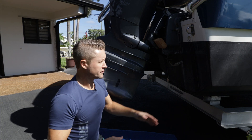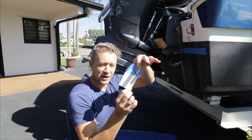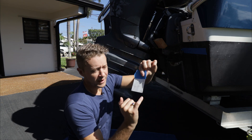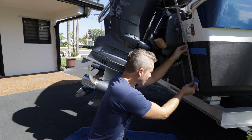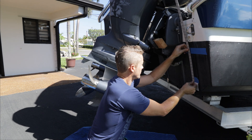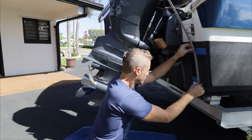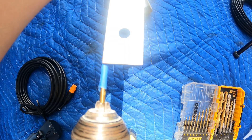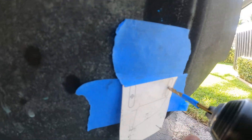I'm going to start by establishing our waterline so that we know exactly where to put our transducer — it needs to be parallel to the waterline. Garmin provides a handy template that you cut out. There are just two screw holes that go into the transom and the bottom corner needs to line up with the bottom of your hull. It's measuring right at nine and three-quarter inches on both sides. Garmin recommends a 5/32 bit for the pilot hole, and I've marked it at eleven-sixteenths so I don't go too deep. Let's get to drilling.